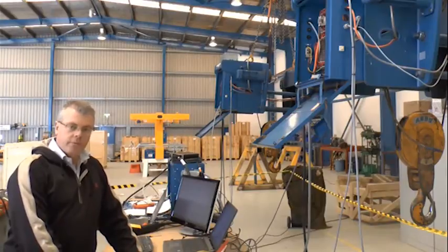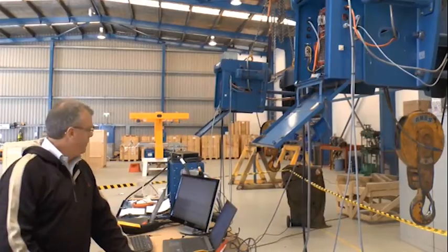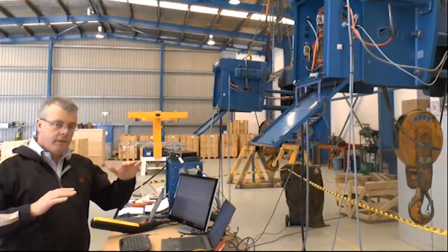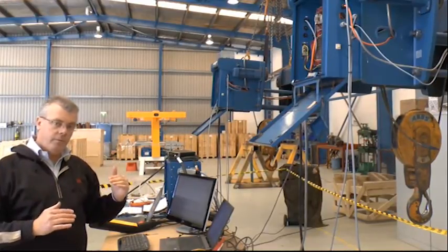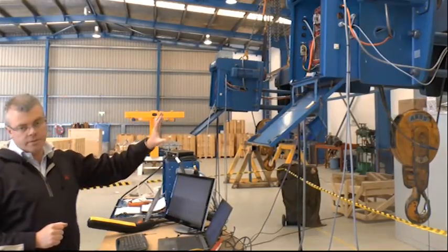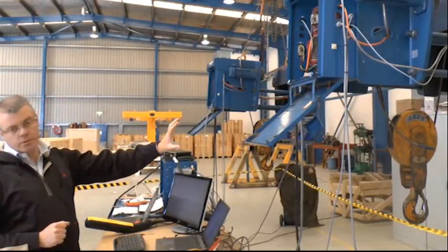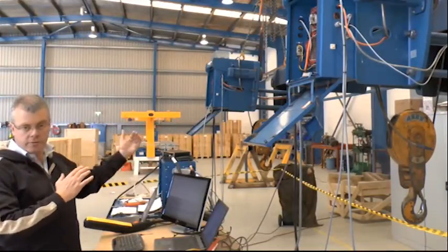For quite a number of hoisting applications, it's critical that both hooks stay synchronised — and when we say synchronised, that they actually stay relative to one another from a starting position. We use encoded feedback up on the hoist to get feedback on what the hoist position is. One hoist becomes the master and the other is the slave, and the slave's speed is modulated relative to the master according to the encoded feedback from each hoist.